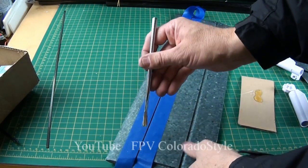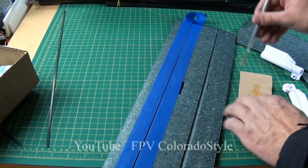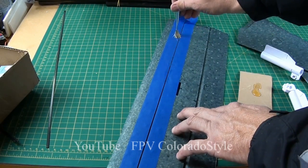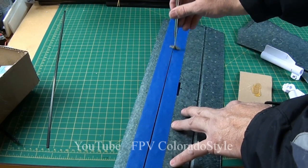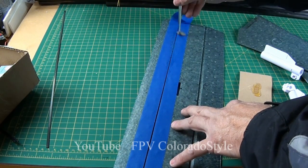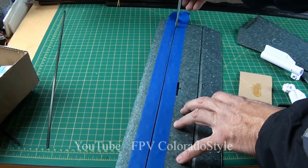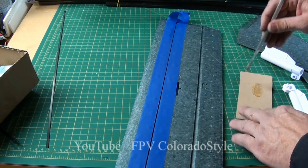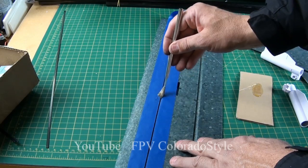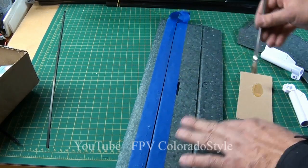If you have those funds, try not to use the contact cement, because you're supposed to put it in, wait for it to dry, and then stick it in — but you will probably not make it to the bottom of the crack before that spar sticks in place. It's also important to make sure the spar is centered between both sides of that crack, sticking out about a half inch on either side.